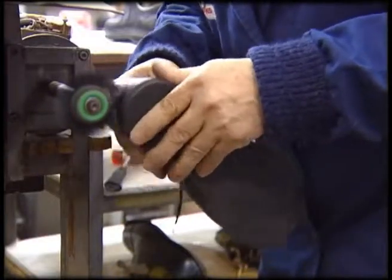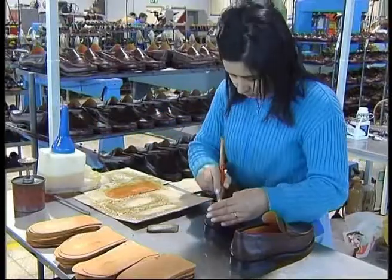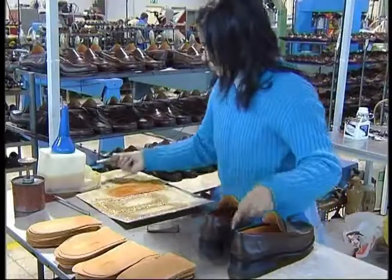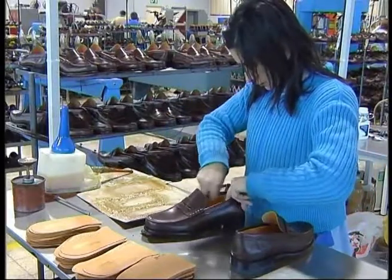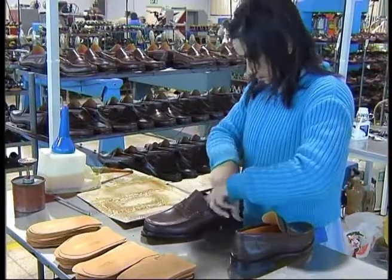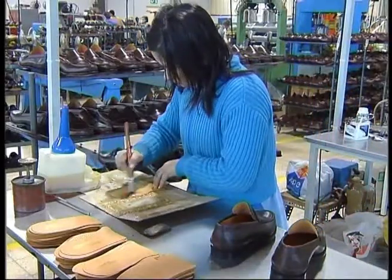Operations common to the different types of finish. To put the sock and/or insole (half insole): this operation consists of the placement and/or cementing of the finishing insole. The glue can be applied manually with a brush on the inner sole of the insole or sock, followed by placement inside the shoe. Alternatively, a cementing machine with spreading roller can be used, through which the insole passes before being positioned inside the shoe.